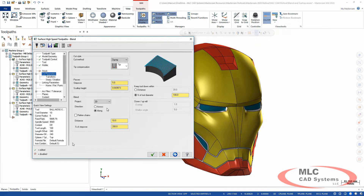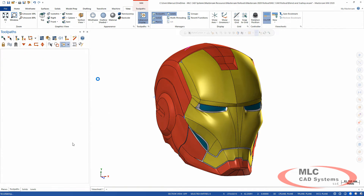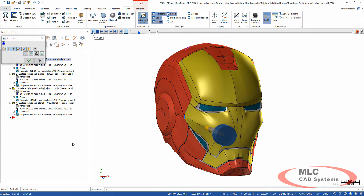I've got tip compensation set up, the step over looks good, and you can choose whether you want to go along or across. In this case it blends up and down in the same direction as those curves, so I'm going along. Let's do a back plot here — it's going to equally space out the passes even though it's a curved or tapered surface from end to end, giving us a nice clean surface finish. You can also decide whether you want smooth movement on the ends or whether you want it to just kick over and start back the other direction.